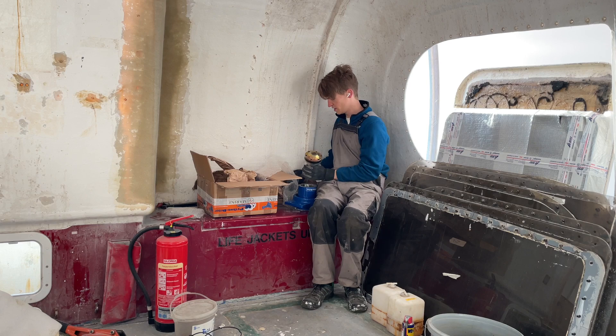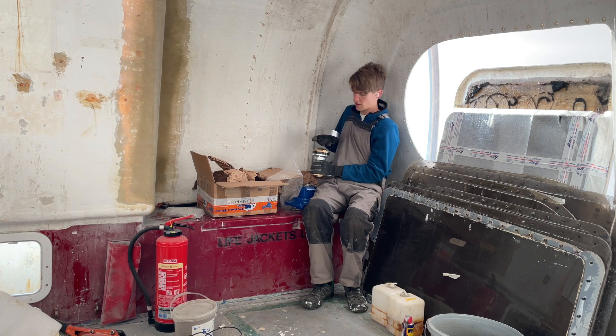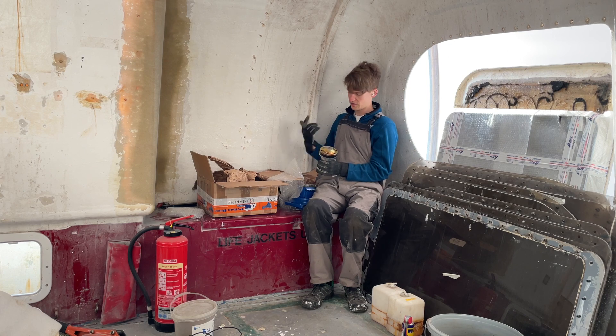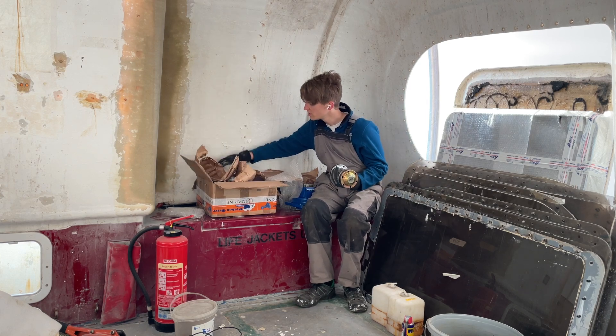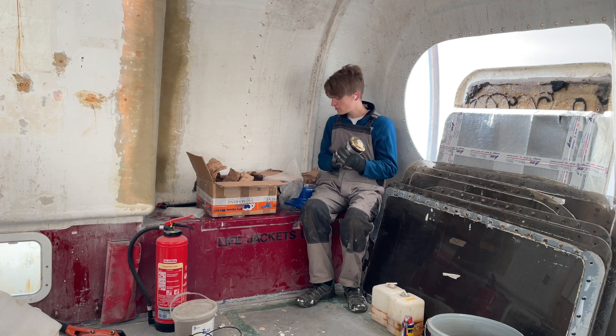So it looks pretty straightforward. This guy goes into the other side of this guy, the adapter plate comes up here, and then you weld something to it. It'll turn in a nice controlled manner without the off-phase turning you get if you have a drive shaft that isn't mounted correctly — which causes constant acceleration and deceleration of the motion. So that'll avoid that.